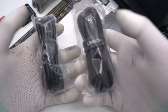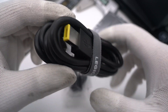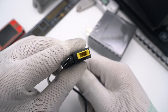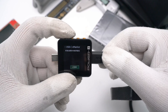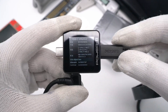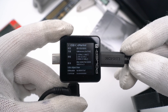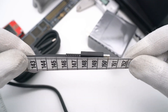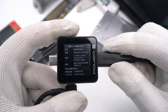Open the box — here are two charging cables and the charger. The first one is the Lenovo customized cable, which can achieve 135W after connecting to the power port of the latest Lenovo laptop. The square connector is yellow and the cable is about 1.53m. The ChargerLab PowerZ KM002C shows it has an E-Marker chip. Since the KM002C cannot detect Lenovo's private protocol, we can only see 100W instead of 135W. The second one is the dual USB-C cable, about 1.5m long. The KM002C shows it also integrates an E-Marker chip.